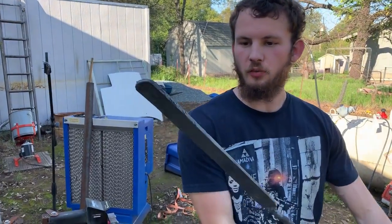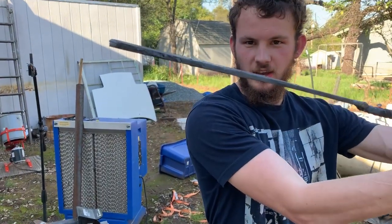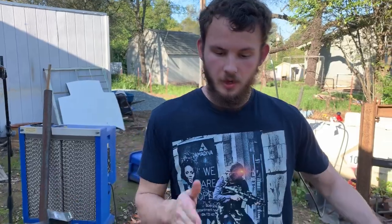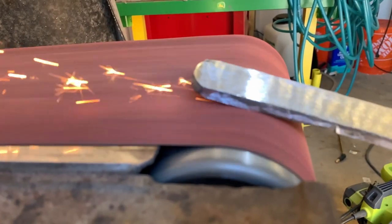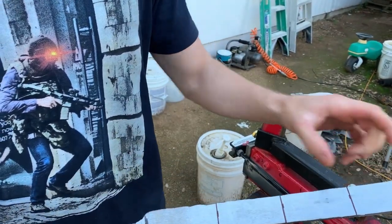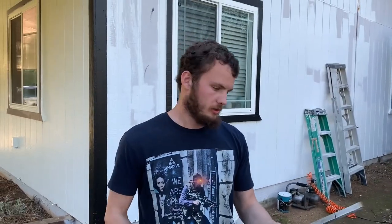So we set our forge welds, hopefully successfully. So that's 8 layers thick, you can't see it. So, next step is to grind this, clean it up, cut it into 4 pieces, and stack them up, and wash, rinse, and repeat. We divided it into 4 even spaces, which we're gonna cut and then stack up, and that'll be 32 layers, and we'll go from there.